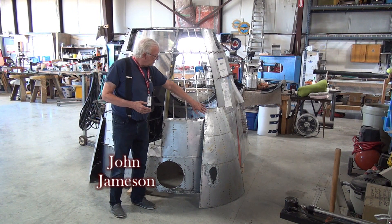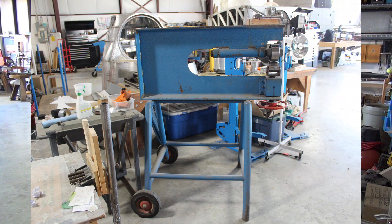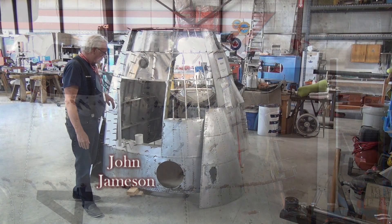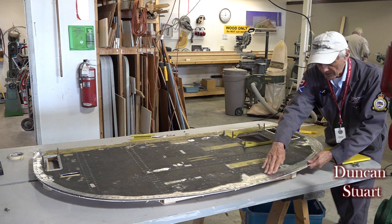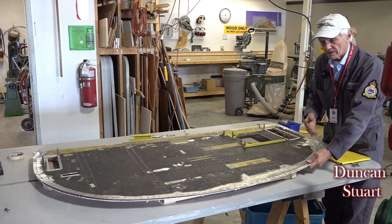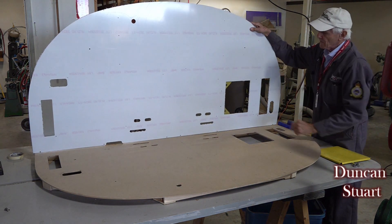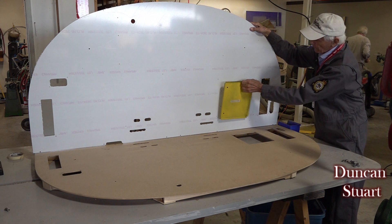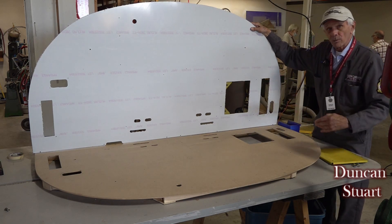Now that this section is done, we're going to make one of these up on an English wheel so we'll be able to shape it in both curvature and radius. It's just one of those little things that takes time and patience. This is the old bulkhead which had a lot of corrosion, so we decided it would be better to make a new one. We positioned it so we could router it to match the old bulkhead. Things like the door will be hinged there so that access to look into the bomb bay would be available.